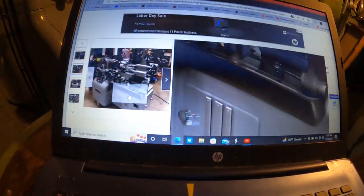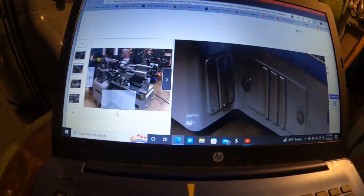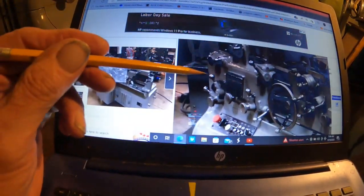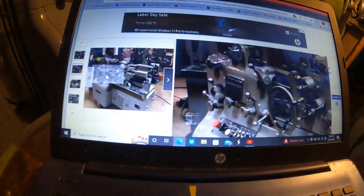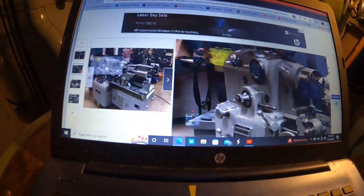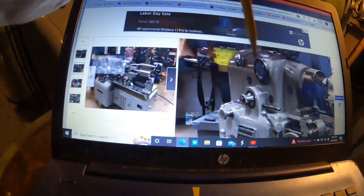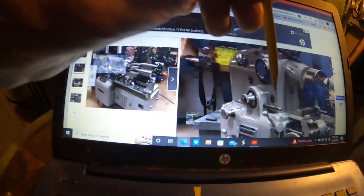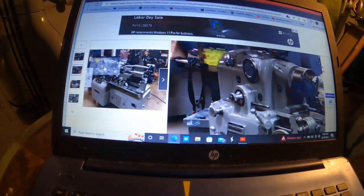What we have here is a pre-1960 machine. It was a motor generator drive at one time. Looking at that cover - it's only got two levers here and you can see the window. That's just a standard inch gearbox with three windows. That's the old oiling system - the bearings sit in oil and they run a little hotter. The newer lathe only has one oil window right there, without the other two. It has oil circulation.